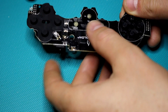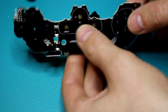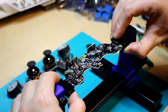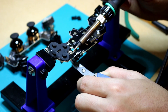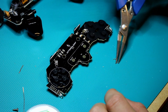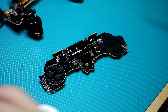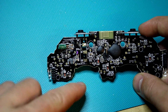We're going to remove the battery terminals for the old AA type batteries. First I took out the plastic cover and now we're going to have to desolder the battery terminals. There were two solder pads for each battery terminal, and I used some little links to solder those pads together — and here you can see on the board it's labeled plus and minus.